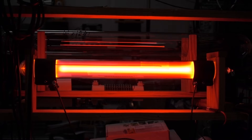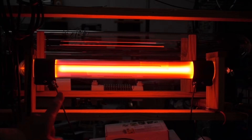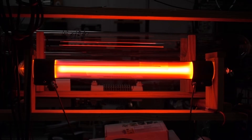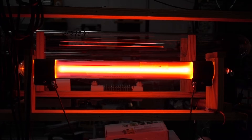It looks like there's a little gap right in here where the discharge is not occurring. That is caused by the fact that the rest of the discharge is so intensely bright the camera stops down and it looks as though the gas is not glowing, but in reality it is. You can see the little gap there with your naked eye if you look. Because we're looking at a slight angle to the tube, just slightly on the left side, the gap at the right-hand side of the electrode is not visible — it's covered up by the glow behind the electrode.